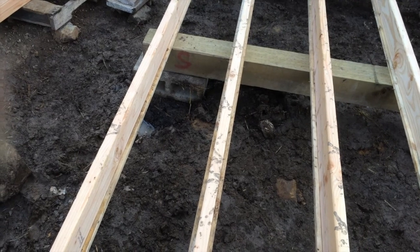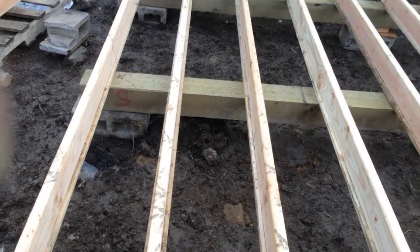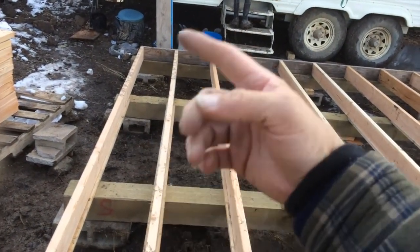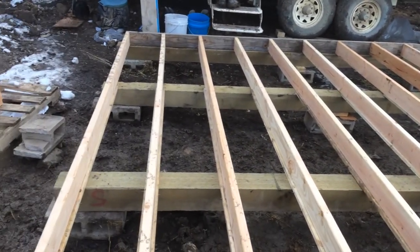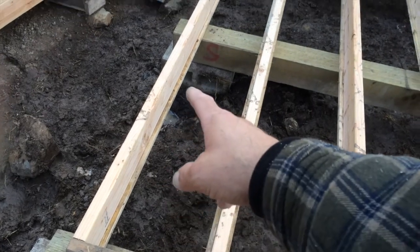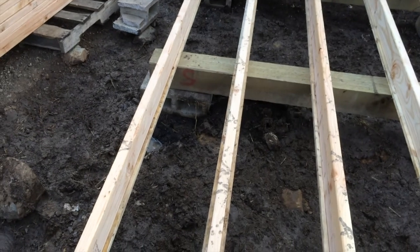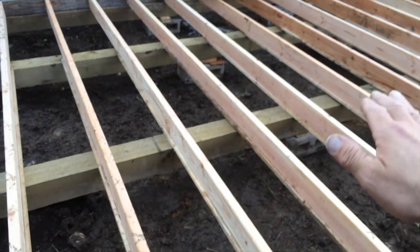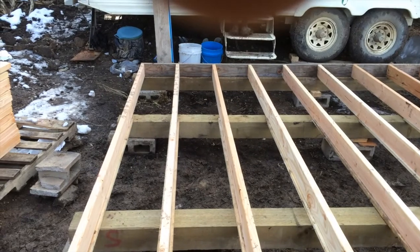I see some people that have netting under each bay. We could technically put netting on top now and then turn the whole thing around with my excavator, but I have a feeling it would be totally skewed and messed up, so I don't want to do that. I think I remember my grandfather, who was a carpenter — he built houses at least. A contractor maybe. So I am going to put OSB on top, then put the insulation on top, and then just flooring. The insulation has a moisture barrier on the back side.